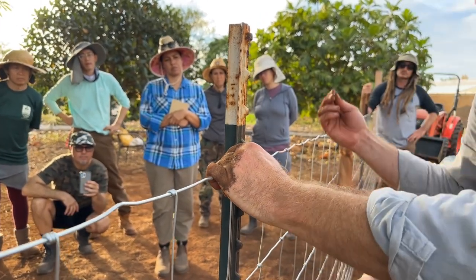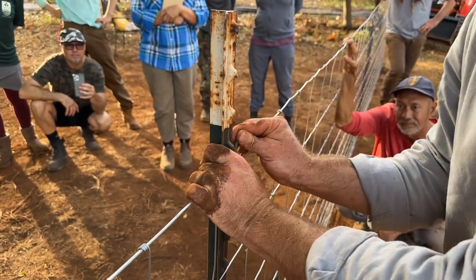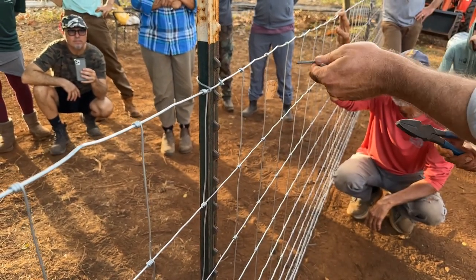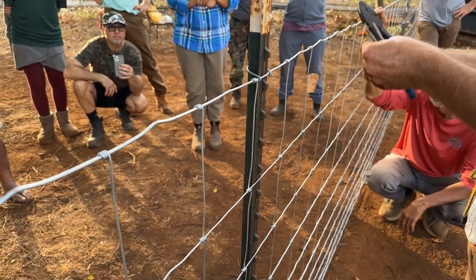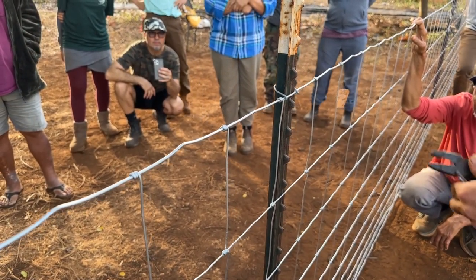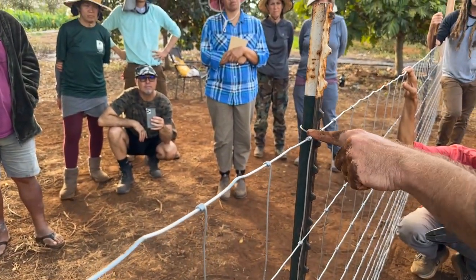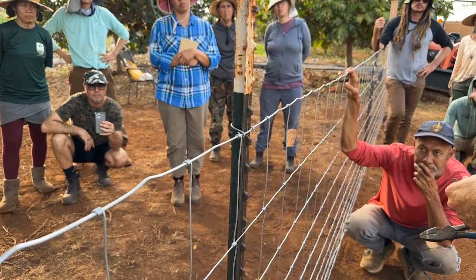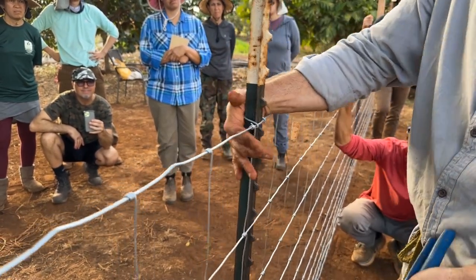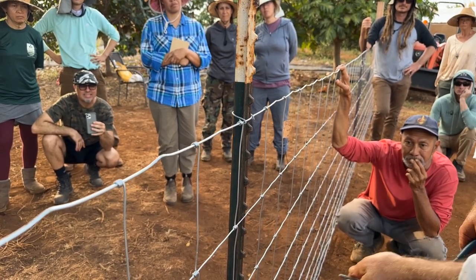And then you've got your second barb. These clips — there's a real way to use them and a way not to. You can see there's like an open end. The open end is what you're going to want to put on first, and then you're going to wrap it around the T-post like so. That's where you're going to come in with your tool. The nail is nice because you can drop it in and it doesn't fall out, but the nail can get a little cumbersome in its own sense. Once you have it on like that, what I like to do is do them all and then take my linemen's and pinch that open side, because I have seen that open side snap off — especially when a horse comes right here and puts its butt and starts scratching. It loosens your fence.